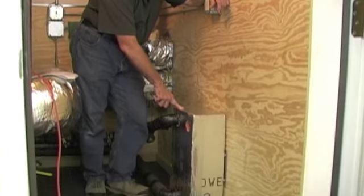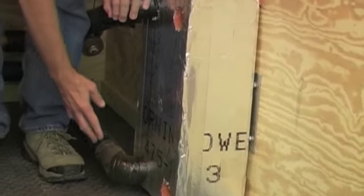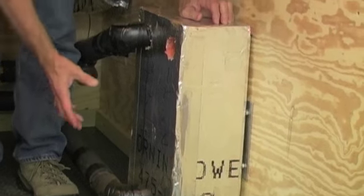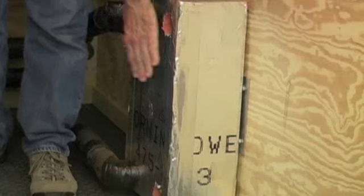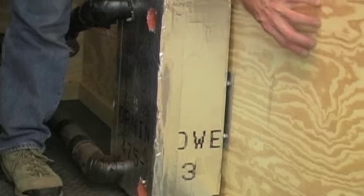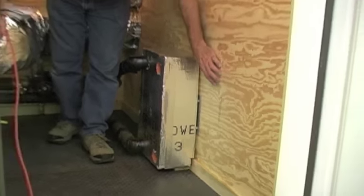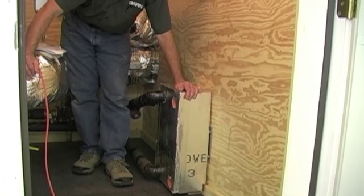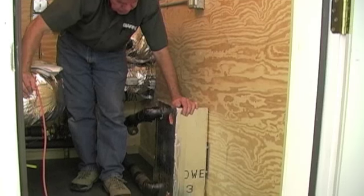This is the heat exchanger. The GARN unit connects on this side of the heat exchanger. There's 2 access ports that are covered. The covers pop right off. This is where the hot water supply and hot water return connect to the building. You can drill a hole any place in this wall, right through the wall here, because this is a stress skin insulated panel building. There are no studs in there.